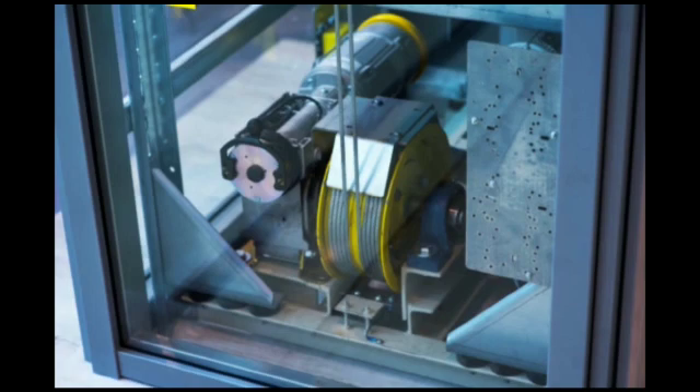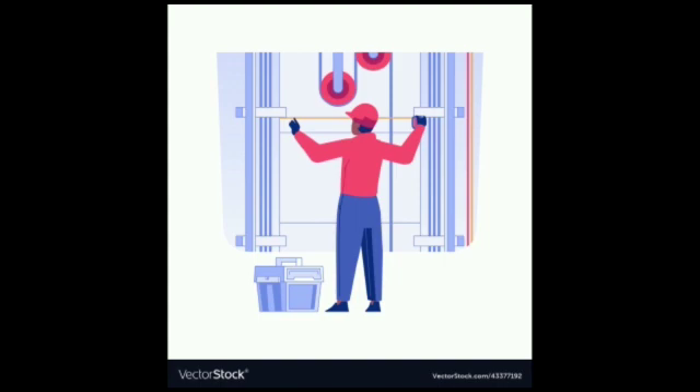With the new lift cabin method, the basic structure of the new lift cabin is constructed in the pit of the elevator shaft, with the first sections of guide rails already installed in the sides of the elevator shaft. The roof of the cabin will be used as a working platform where the technicians will install the new guide rails above the cabin. As new guide rail sections are installed, the lift cabin is slowly winched up the shaft by the wire rope hoist, like the Unilift hoist.